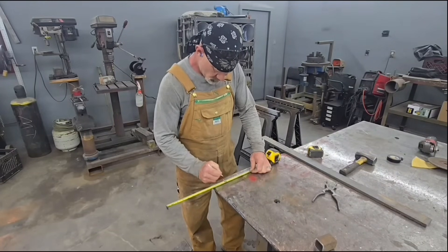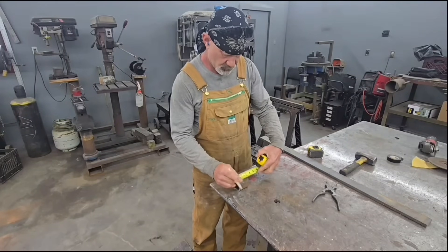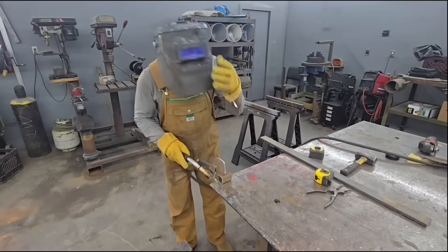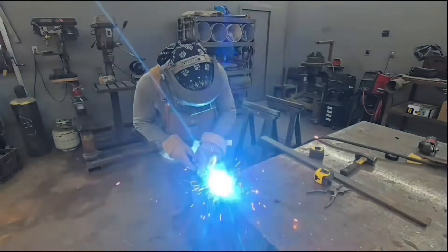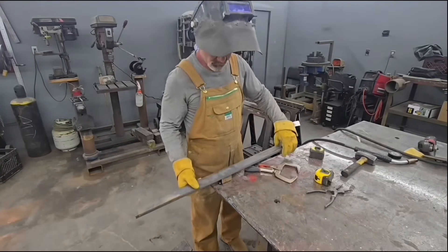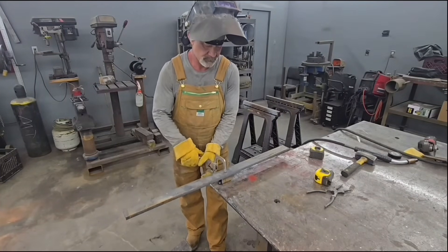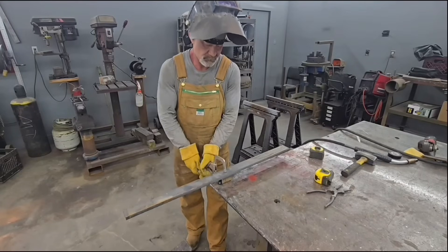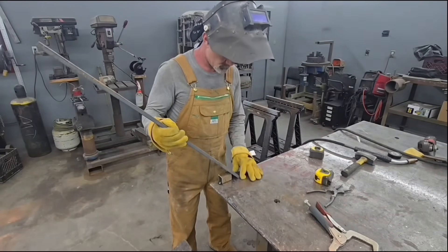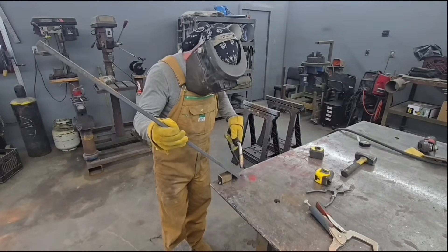I get the outside diameter of the whole piece at six and three-quarter inches, then I come back and mark three and three-eighths to find center so I can center up the inch-and-a-half tube and tack it to the table. I go ahead and use the half-by-two flat bar, get my clamp adjusted right where I need it so it's ready to go later in the heat of the torching. Then I hold the flat bar up in place at about 45 degrees and weld it to the table.